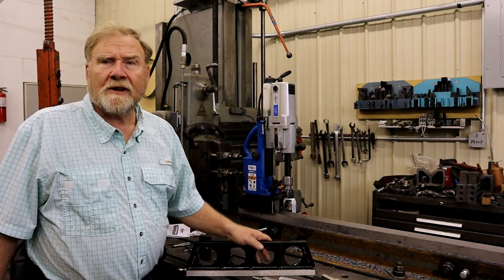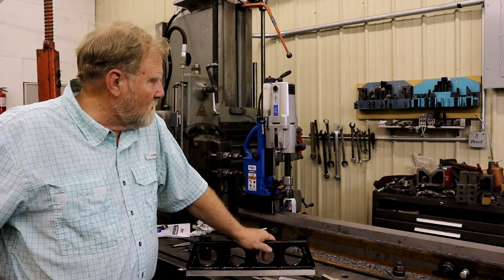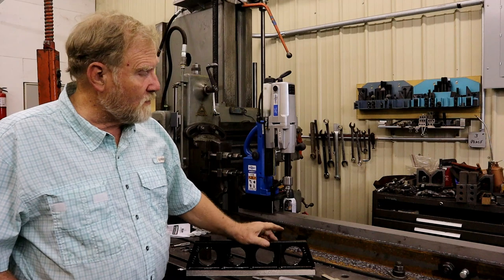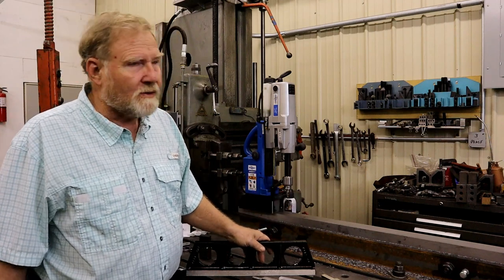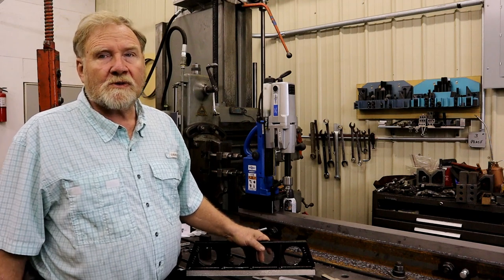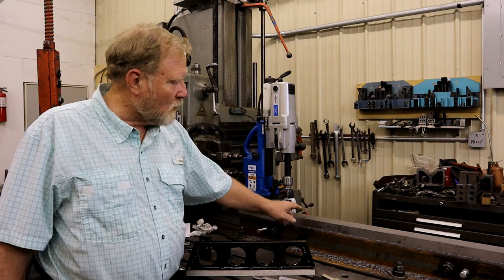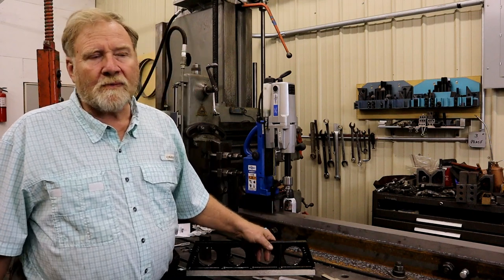You're looking at a defeated man. I have spent 2 days now fighting this straight edge of Miles's. I showed it to you in one of the first planing and scraping videos. He brought it over to me. It won't hold its shape. It was twisted, and it moves every time he scrapes it. So I heat stress relieved it and was planing it. And people were talking about the first video about that hole. So I said, oh, what the heck? Let's go ahead and try another way of fixing it.